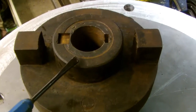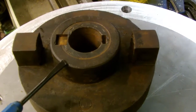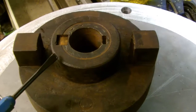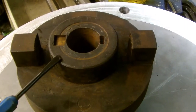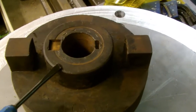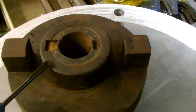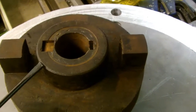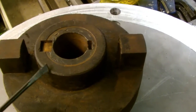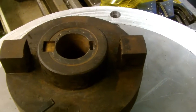The original motor was a 10 horsepower beast which I had to remove because I would have had to have bought an expensive converter to power it, and also probably upgraded the entire supply to the garage to handle the extra current. So that wasn't an option. What I eventually decided was I was going to get a really beefy single phase motor, knowing that it would be nowhere near 10 horsepower. What I managed to find at the time was a 3 horsepower motor.